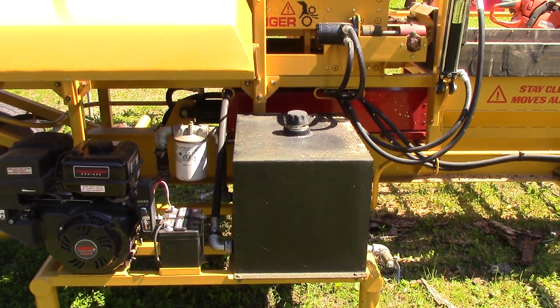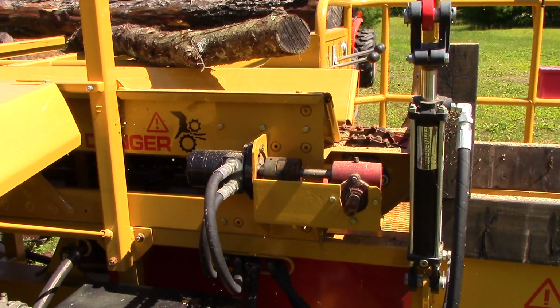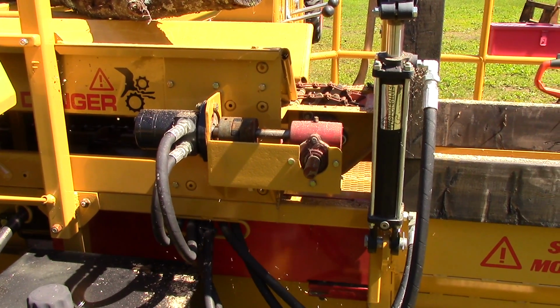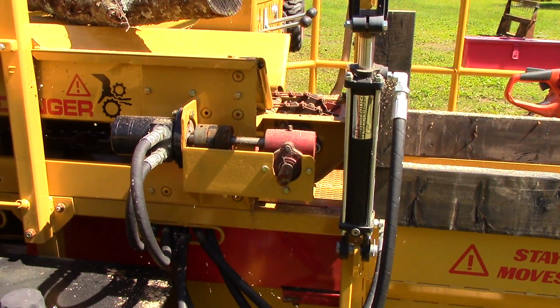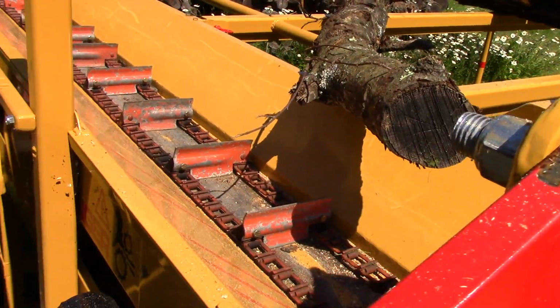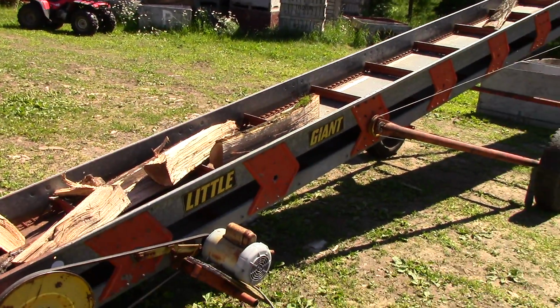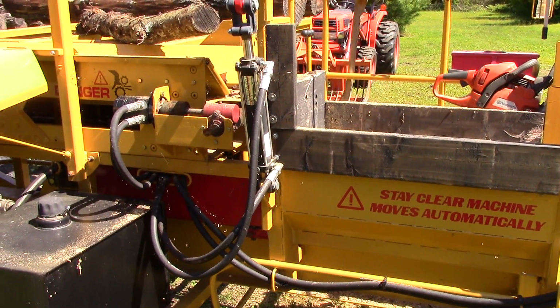And then I have a six-way wedge, so when it's all the way up, it only splits the piece one direction. Then I can lower it for about an 8-inch log to cut it four ways. And for bigger logs, you can cut it six ways. From there, the pieces go through here, and this is kind of just a mini chip separator for the little chunks to fall out. The big pieces land in the conveyor and forward off into the boxes or trailer or whatever I'm filling.